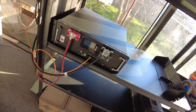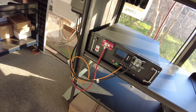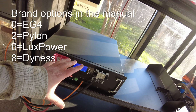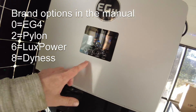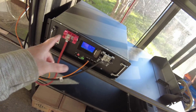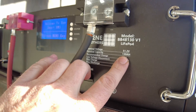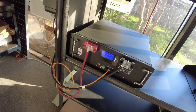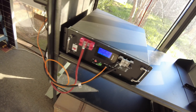That's really easy. You can hook these up to third-party batteries pretty much no problem, as long as there are different protocols you can select in the battery you have. As long as you have one that supports Pylon, you can select Pylon in the inverter and it communicates perfectly fine. This battery is 130 amp-hours — we can see that where it says Capacity: 130 amp-hours. This is bigger than our typical 100 amp-hour, 48-volt battery. Christopher Bean has packed in some extra battery capacity into these things.